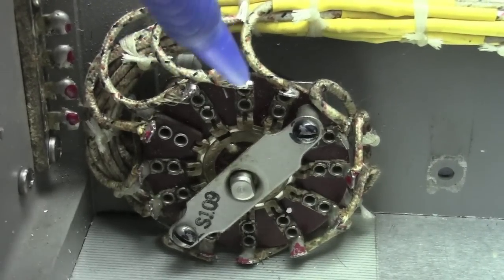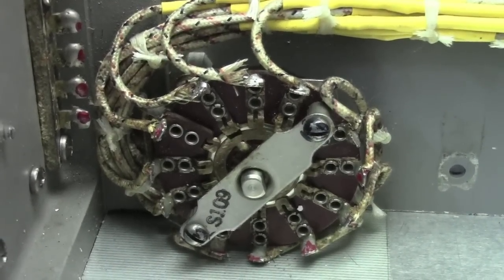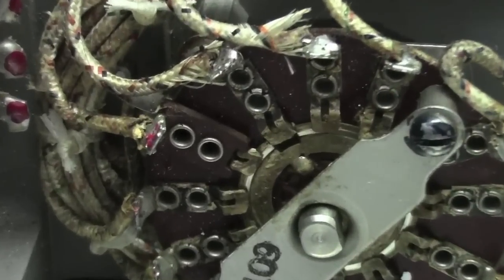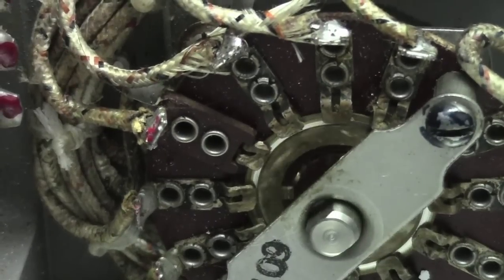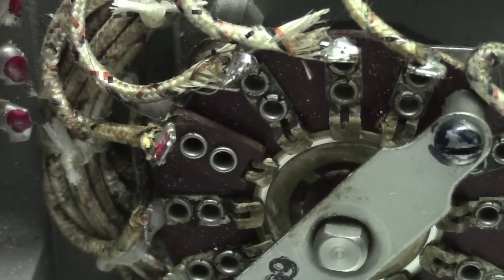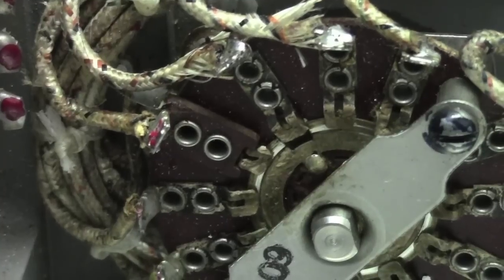And I might point out that if you look at that closely, you find very little area on each side of the switch. That is why if you have a motor that goes just a little bit, it'll never tune. That motor's got to brake instantly when it returns, when the reversal happens. It can't drift. One of the most critical spots of the operation of the AutoTune.